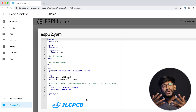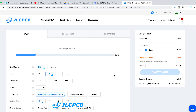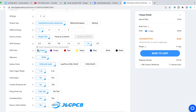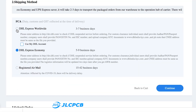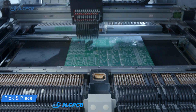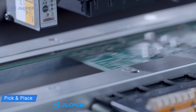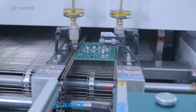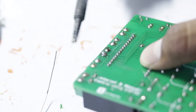We also designed a custom PCB for this project and placed the order directly with JLCPCB. You can download the Gerber file for the project and order the PCB from JLCPCB by uploading the Gerber file, selecting the color masking, and paying for your order. If you select the fastest delivery option, you may get the PCBs delivered within a week. You can also try their assembly service to get all components soldered on one layer of the PCB.